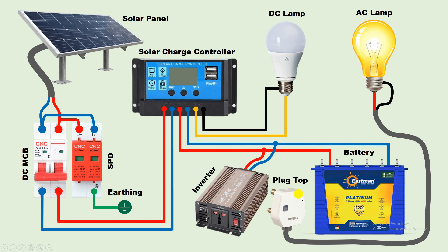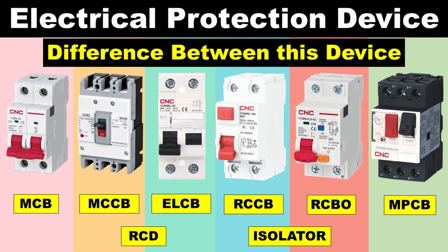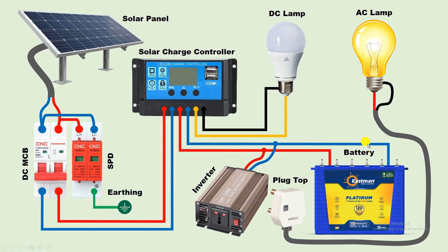Friends, in this connection I showed here, I used only a single bulb. If you want, in place of a single lamp, you can provide power supply to all the lights in your home. Simply take this plug top with the power supply and connect it to the MCB of your home — the MCB for lights. The benefit of connecting this wire with the MCB is that wherever the power supply is going through MCB, in all those places, power is supplied through the inverter. Friends, if you want to know how many types of protection devices are used in our home, then click on the right-hand side video. Thanks for watching.